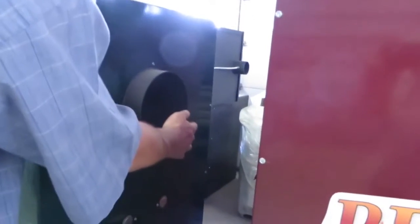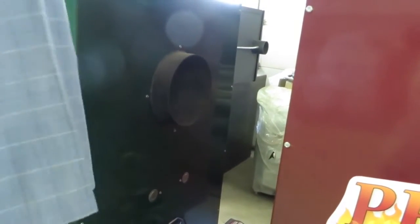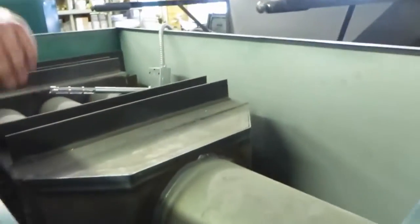This is your chimney exit. The 2850 through 3050 models use an 8-inch chimney, and the ones larger than that use a 10-inch chimney. You can see how hefty and heavy-duty the construction is. Notice the combustion chamber has a stainless steel body with fins welded the whole way around. Those fins do two things: they greatly strengthen that combustion chamber, and they help pull the heat off very fast — acting like a radiator. The heat gets trapped in the fins and the air blowing around it through the duct fan radiates it off very rapidly, protecting the steel and maximizing efficiency.